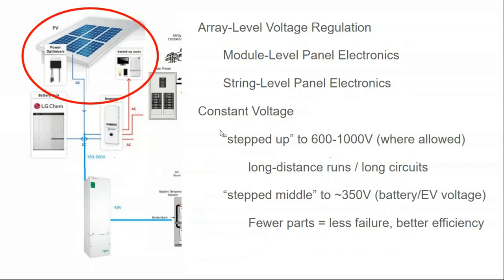So we have our solar array up on top of the roof. It's meeting the rapid shutdown requirements, that you have to de-energize the solar array with a touch of a button, and these module level power electronics are able to cut power right up on top of the roof. What's nice about the voltage optimization is you don't need that many circuits of power up to your rooftop, and you get this nice high voltage DC coming down. Normally it would end on the SolarEdge inverter down below.